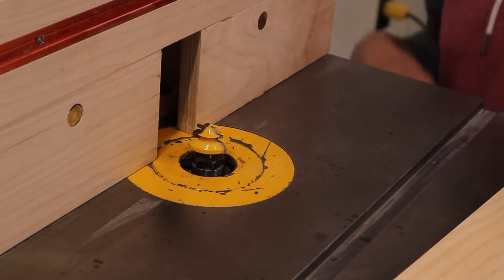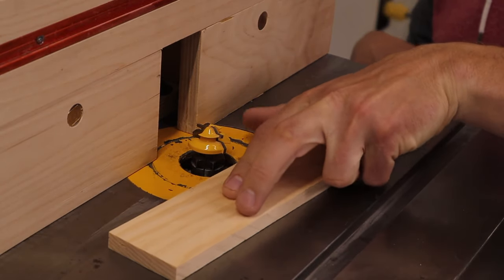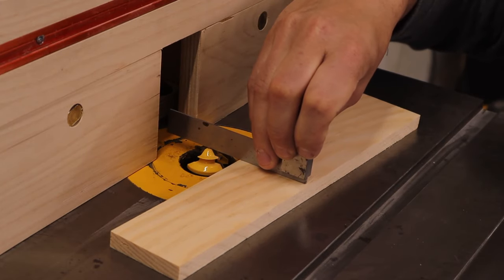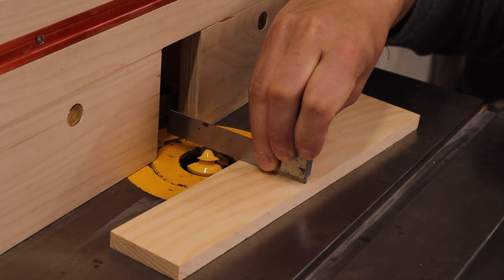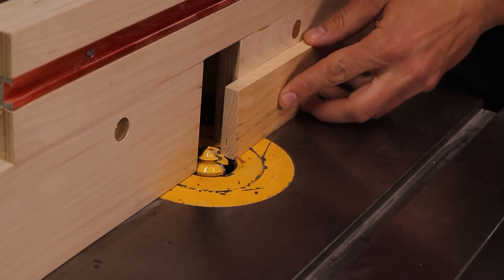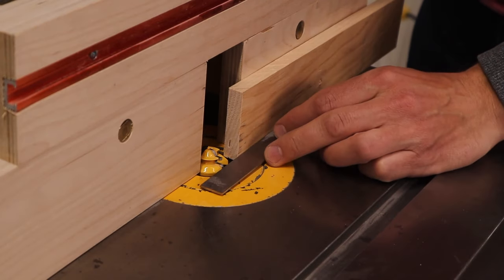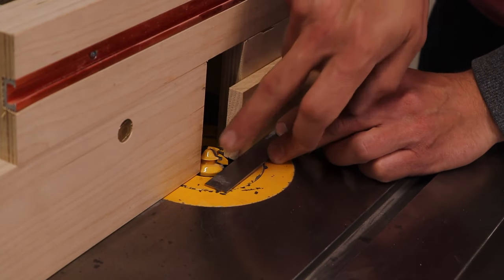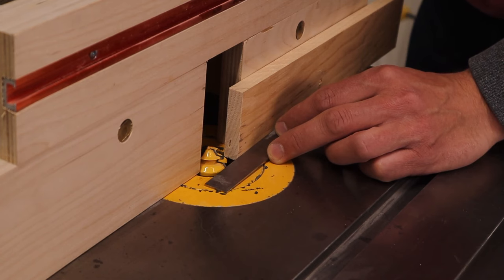If you follow my techniques and tips, you're going to get perfect results every time. Let's head over to the router table and get the bit thrown in there. First, we're going to adjust the height of our bit. You're going to need a piece of your stock and a straight edge of some sort, and just lower the bit until it's just touching the top of your straight edge — adjust it accordingly until it just touches. Next, we're going to adjust our fence. We're going to put our straight edge on it and bring it in until the bit is just touching the edge of the carbide tips. Then tighten down your fence so it doesn't move.